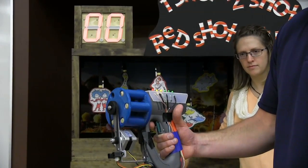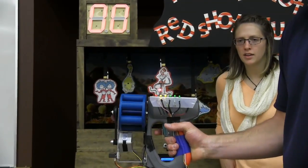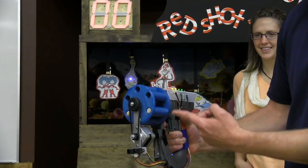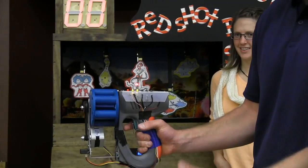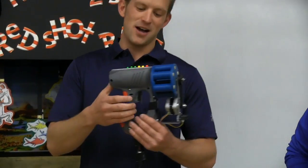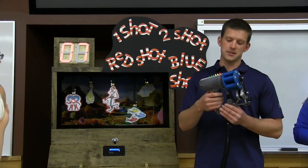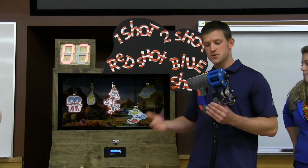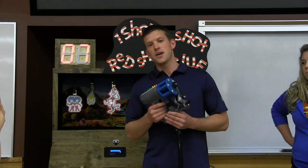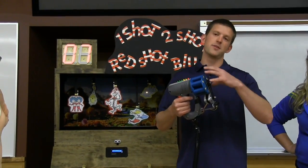The barrel rotates around until it hits the position switch at the beginning, and when you fire it, the barrel rotates to the next shot. The light goes out every time you fire it. It's actually a staple gun — it had a manual trigger that could be fired at any time. What we did is modify it to be electronically controllable, so the trigger sends a signal to our Arduino Uno which controls the gun. The Arduino Uno then decides whether or not to actually activate the solenoid, depending on whether the barrel is rotating or if one of the sensors are tripped.